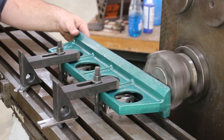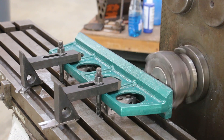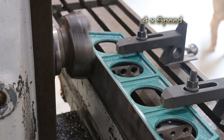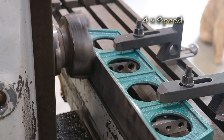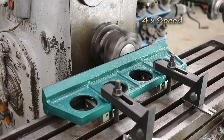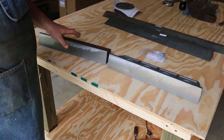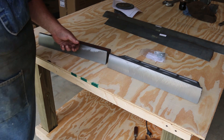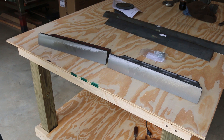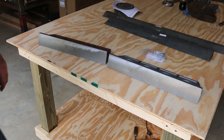We've got our second ops going here now. Basically we just laid these over flat on those milled surfaces. I've got some 1-2-3 blocks underneath the bottom raising it up off the table, and we're coming in now and milling the bottom of the straight edge flat. We went ahead and got the backs milled on all three and then got all the bottoms milled. You can see a nice milled surface on the bottom. These should get them pretty darn close to flat before scraping class.